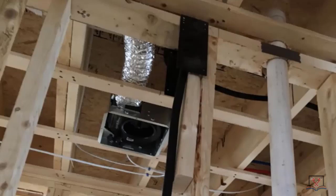A proper ground could be happening at an appliance that the CSST is hooked up to that has an electrical outlet that the gas appliance is plugged into, or maybe it's wired. Most gas appliances now are going to have a ground — they're going to either be plugged in or hardwired, if they're connected to CSST. And if you don't cut too much of the jacket away, and you know how to install it because you were well-certified and you're a craftsperson, then everything is okay.